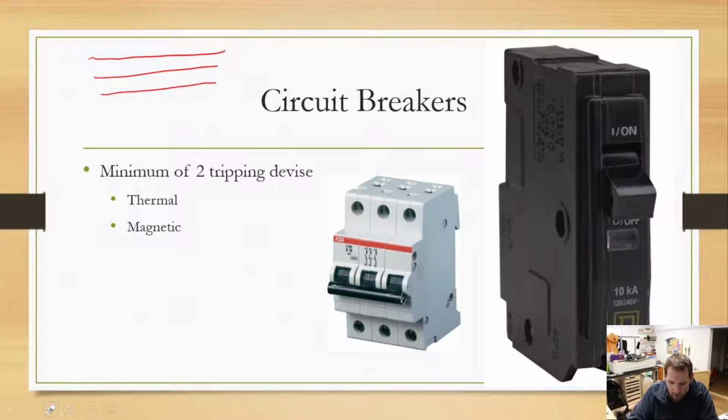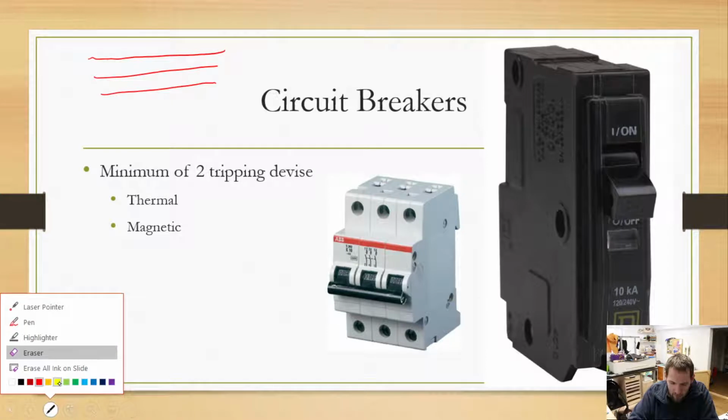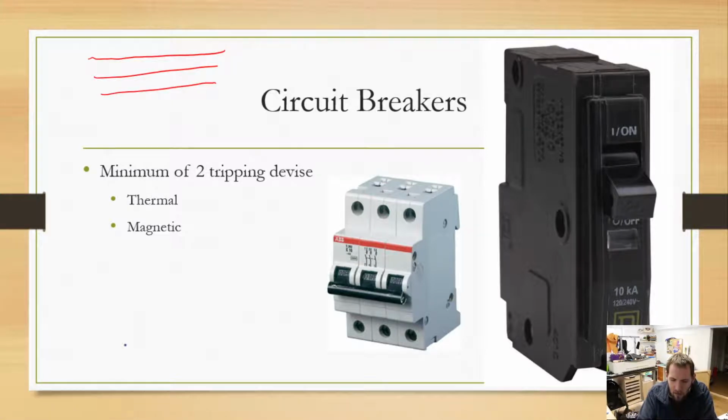All right. Anyway, we don't have a red wire. We have three wires. We have a black wire, a white wire, and a green or a copper wire. So either it has a green coating, or there's no coating at all and it's just bare copper. The white wire is what's called our neutral. We'll come back to this probably next class. Our black wire is what we like to call the hot wire, and our green is our ground.